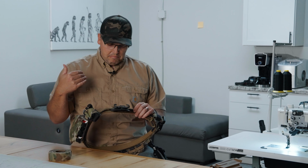Instead of doing a stitch from the top to the bottom of the belt and going back and forth several times, we basically have a bar tack every 1.5 inches all the way down the belt. And you'll notice sometimes that there is a slightly different looking bar tack at the very ends. The ends don't have the luxury of having essentially a shared weight throughout it. So we do put a few more stitches in the end, and you sometimes see there's 2 stitches, and that is usually to just close out the 1.5 inch, kind of the mil spec essentially, and then if we have a little bit left to go to the tag, we'll put in another stitch there just to ensure that it stays put.